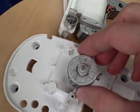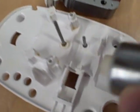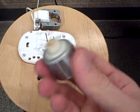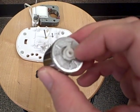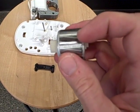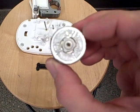Next I'm going to remove the rotor itself. The rotor simply sits on a lubricated shaft. The rotor, as you can see, is nothing special — it's simply a drum made of aluminum with iron bars inside. The iron bars provide magnetic continuity from one side of the rotor to the other.